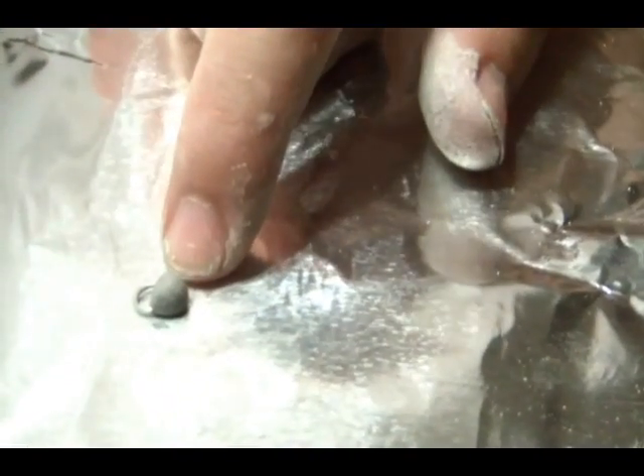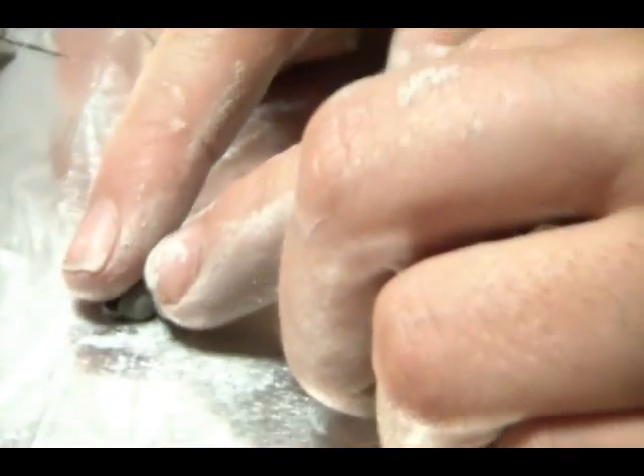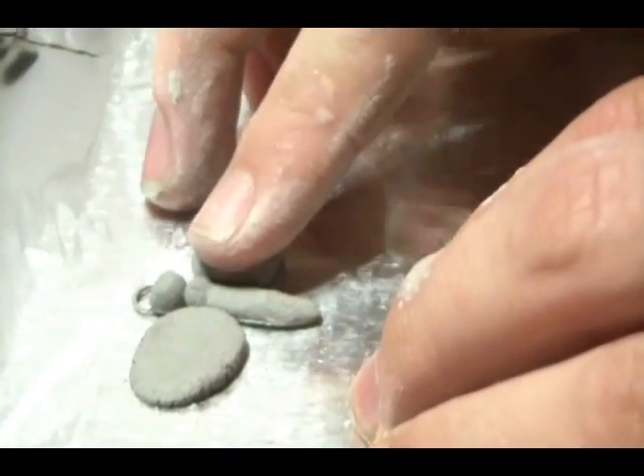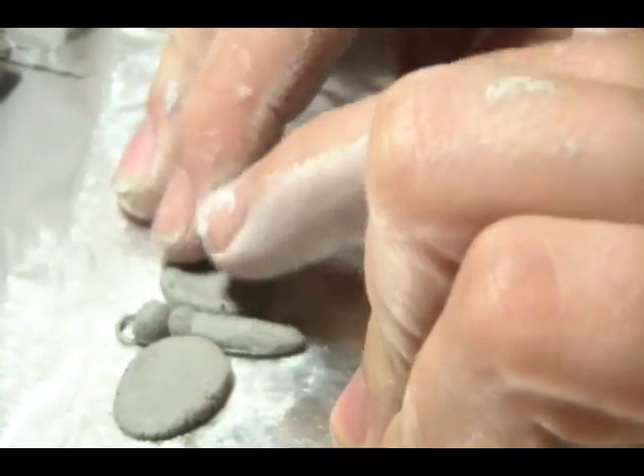Here I have a lump of modeling clay with a jump ring in it. What I'm doing now is constructing a clay shape, making sure all the parts have really good contact and overlap, and are nice and thick. They can't be too thin because there's going to be metal poured into the holes left behind. We want it to be thicker than desired, if possible, to leave a little extra leeway for when pouring the metal.